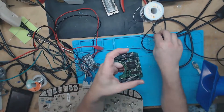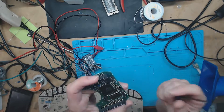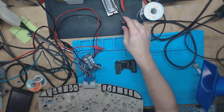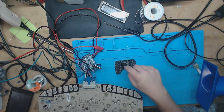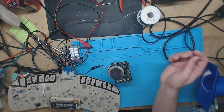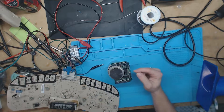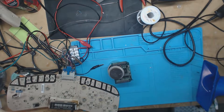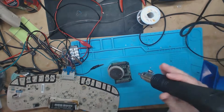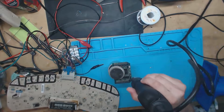This will involve taking the EEPROM off, just like I do the newer ones where the EEPROM comes right off, and then I reprogram it on the computer. So let me go ahead and take care of this. I've got the screen back together and back on there. Now I'm going to get this EEPROM off here — put a little chip quick flux on there. Let's go ahead and get the hot air station. Got the device of much gravity here holding it steady for me.